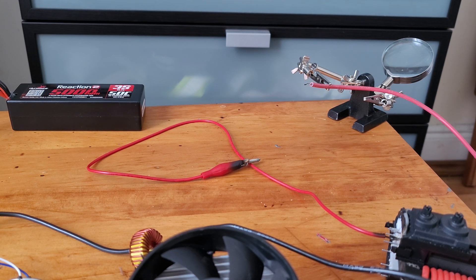So just by putting a capacitor in series with a resistor from the drain to source, the MOSFET stays nice and cold. Now I'm still going to try to improve the circuitry and see if I can get even more power out of this thing, still from a 12-volt battery.